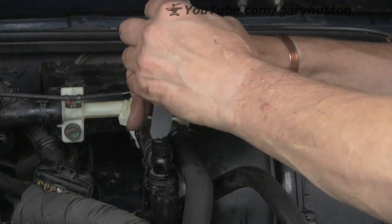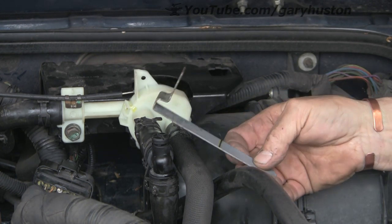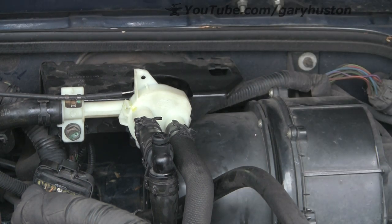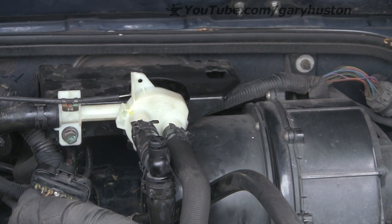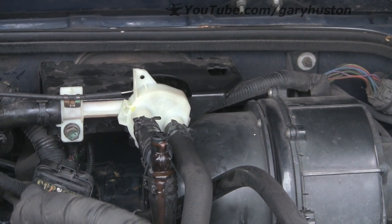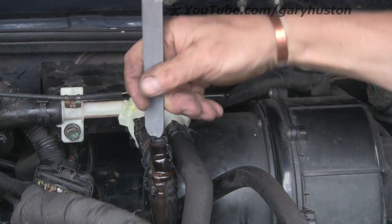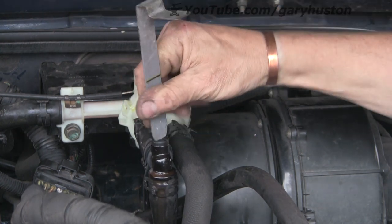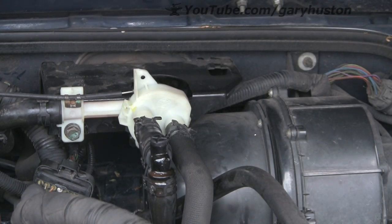So this is your bleed screw — just leave that partially open. Now this little tool I made from a bit of bent up sheet metal — I use it as a dipstick — it's also handy for undoing that bleed screw. I'm just going to start her up and you'll see within seconds it will self-bleed. There we go — by the time I've jumped out, it's bled. And that's it — bleeding process over.